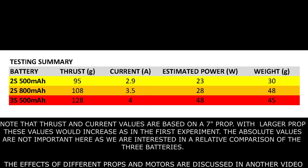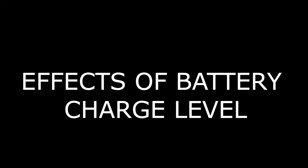An important point: in the industry we usually only associate power and performance with voltage or number of cells — you need more power, so you upgrade from 2S to 3S. But if you need just a little bit more power, it may be better to increase battery capacity instead of voltage, which will also increase your flight time. The bigger moral of the story is not to solely rely on the numbers, especially the discharge rate, but rather to test and verify the performance of your system.